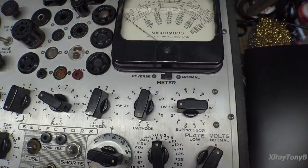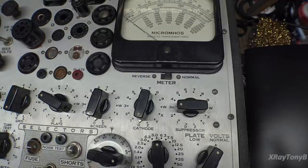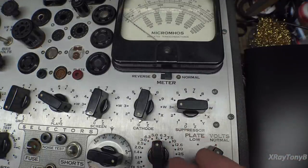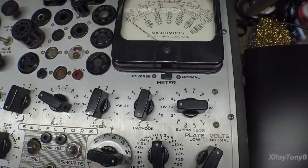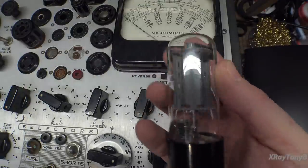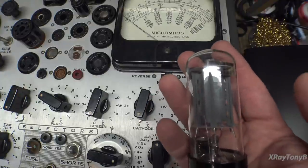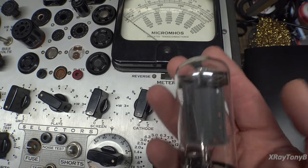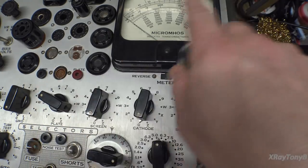So why is this important? This will actually set the tube up in a condition like it would be in a circuit. It heats the filament up, puts the cathode at the common point, applies a higher voltage to the anode, and then puts an actual control bias voltage on the control grid. Now this still isn't perfect — it's not going to test everything under every condition and it does not do it under high current. A 6L6 is a high current output tube, so it's going to have a good bit of plate current in its normal operating range. This tester won't put near that amount of plate current on it, but it does put plate current to some degree.